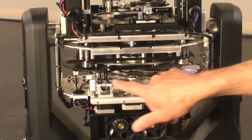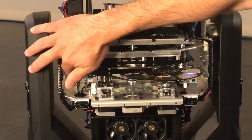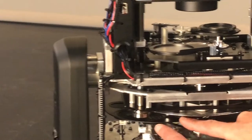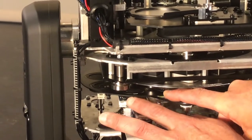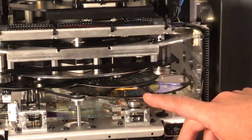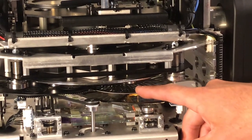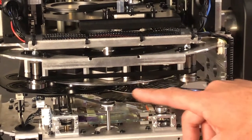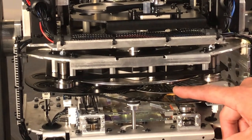You see this gear and it runs back to this plate, which is a gobo plate. On that gobo plate, there's another motor that can spin the actual gobo around so it can rotate. Off to the side over here is the color wheel. Above the color wheel is an effects wheel. The effects wheel can be used in conjunction with any of the other wheels, and what it will do for the gobo is make it kind of twinkle.